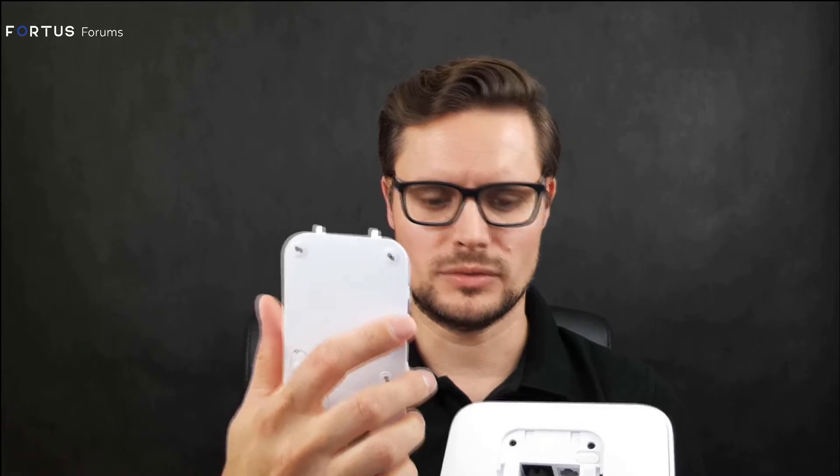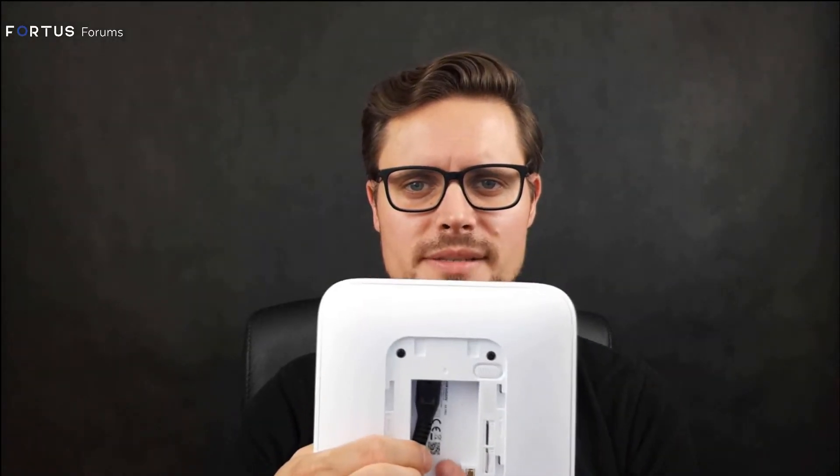The unit is 2.4 GHz wireless and also has a LAN connection at the back, so you have the ethernet port. If it's a 96 series, you would have two SIM card slots — I have one SIM card already occupied here. There's a tamper at the back as well and a latch that slides in, basically a bracket to fit into the wall. Just under the cable you see here, there's a QR code. You're going to need that QR code to enroll this system to your HikConnect app on the phone. You can take a note of the serial number or just scan the QR code.